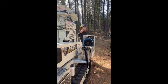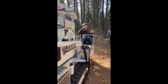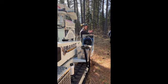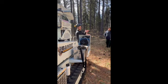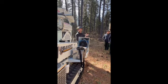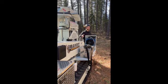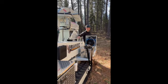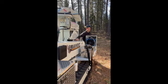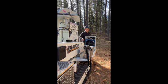And what happens when you're running this machine down the road with this clutch disengaged, that drum stopped, that wood is going to slowly vibrate. It's going to fall underneath that drum. When you go to engage your clutch the next time, that knife is going to come around and it's going to jam itself on that little piece of wood. A lot of times when that happens, guys try to force it in. They try revving it up and dropping that clutch in gear. You just bought yourself a new clutch. Just to give you an idea, this clutch pack is about $1,500 and they're back ordered like a pain in the butt right now. So please, our goal is to not replace this clutch pack.